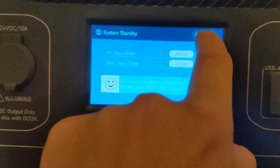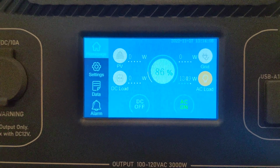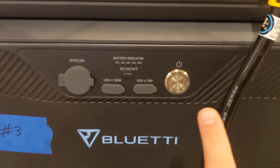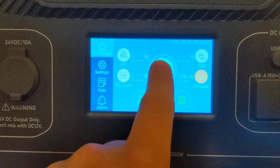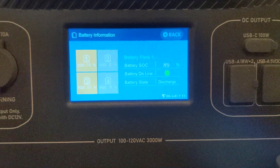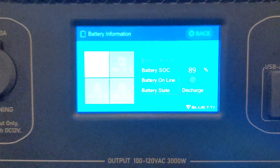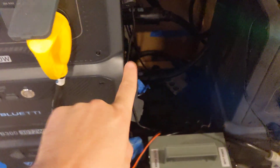Now I'll come in and try to shut off the battery — and this time it shuts off. I go into the battery status, click on the percentage, and I can see two batteries listed: one and three. Battery three is the one we shut off — no power — and battery one is still on. Coming back to the main screen, once battery three is gone from the screen, you can hot swap it.